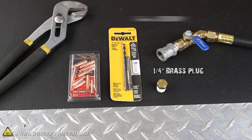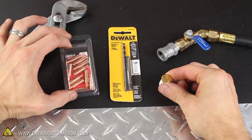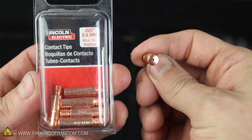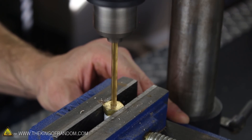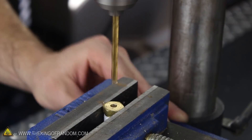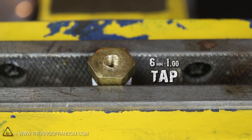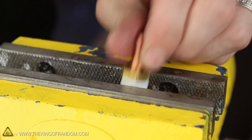Let's move on to assembling the propane nozzle. For that we'll need the brass plug from earlier, a 6mm tap, and a wire feed welding tip. You could save money simply by drilling a 0.6mm hole directly into the brass plug itself, but I'm using wire feed contact tips because they're replaceable, they look cool, and the hole is exactly the right size for this torch. Go ahead and drill a 3/16 inch hole directly through the center of the brass plug. It's important to get the hole as straight as you can, so I'm using a drill press I found at a garage sale for $20, but if you've got steady hands you can make it work just fine with a cordless drill as well. The next step is to cut inner threads on the hole so the welding tip will screw into place, and an M6 x 1.0 tap works great for that. I added thread tape to the welding tip just for good measure, and with a few flicks of the fingers, we've got a good looking propane nozzle ready to join the system.